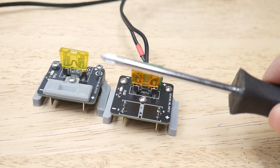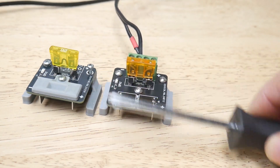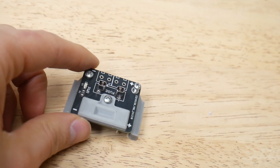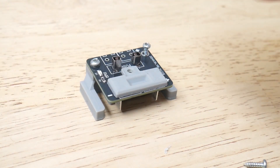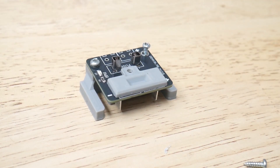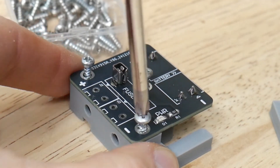Okay, hold on — I've got safety in mind with having a fuse in this whole assembly, so these little live terminal bumps that you could incidentally short out, I have to fix. So I made this 3D printed bumper that is secured with the middle screw, and while I was at it, I changed all the threaded insert holes to M3 thread-forming screw holes, so it reduces the mechanical fastener parts by half.